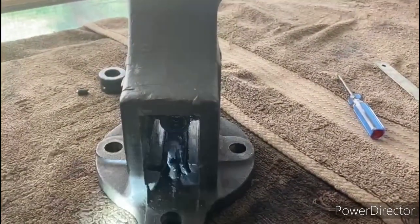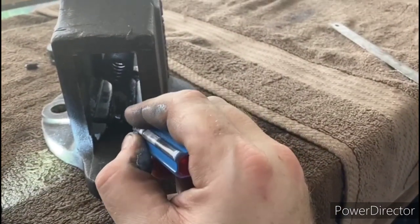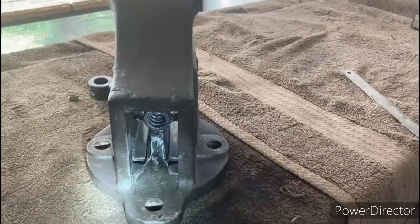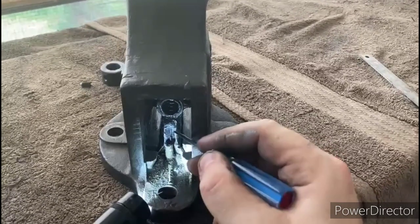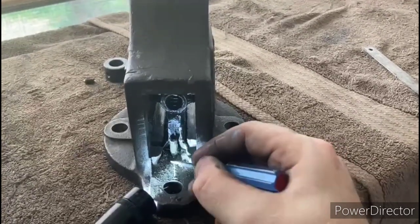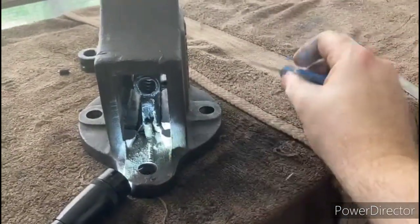This nut is just a cast iron nut held in place with a little pin. The cast iron nut just pushes inside of here, held in place with the pin. There's no way to take out any backlash or any slop that develops in there as the screw wears out. These ways right here are just cast — it's a cast nut that fits in this little triangular-shaped space, but this is all cast in here; it's not machined in any way. So it's not a precision fit by any means — it just fits in there snugly, held in place with the pin.